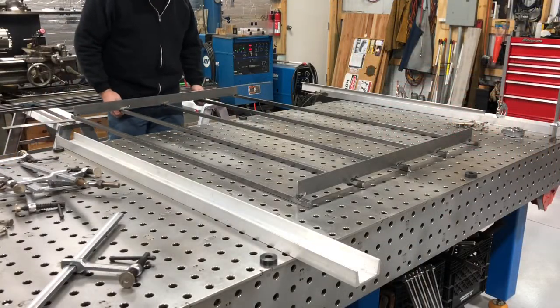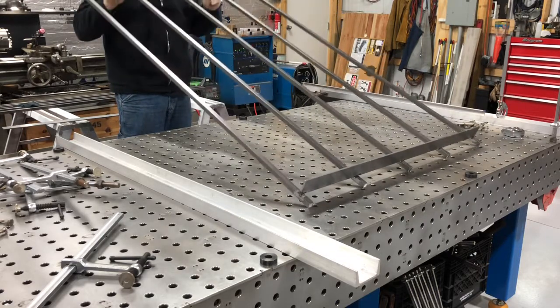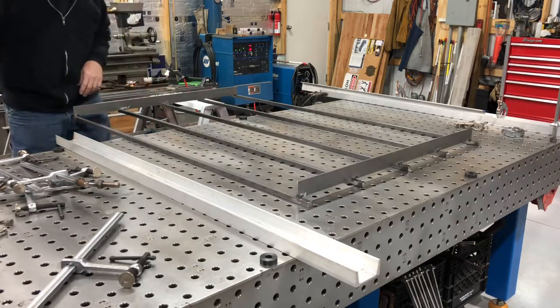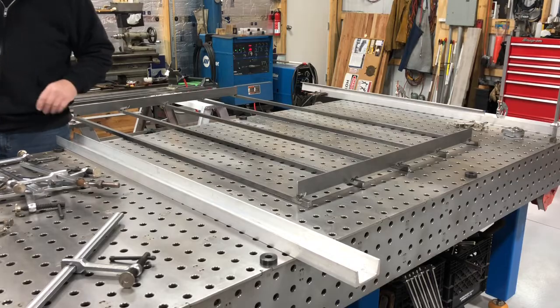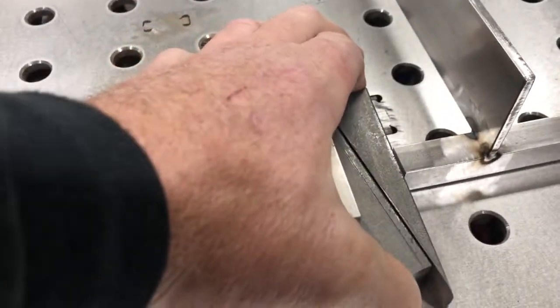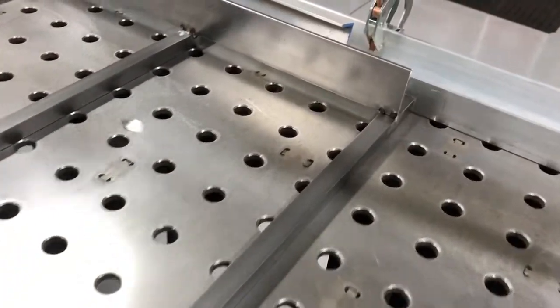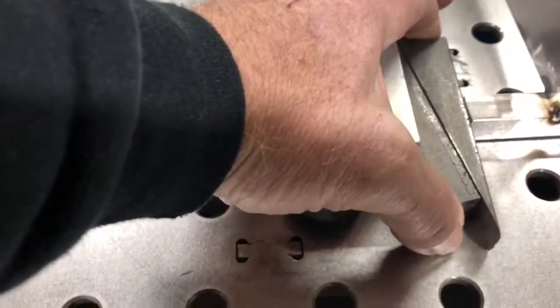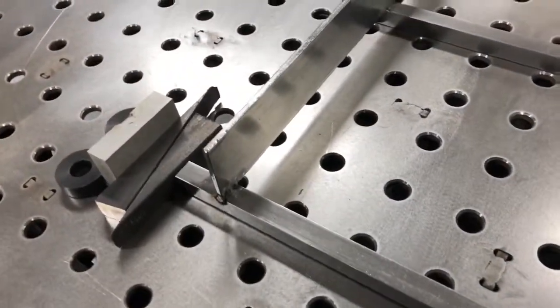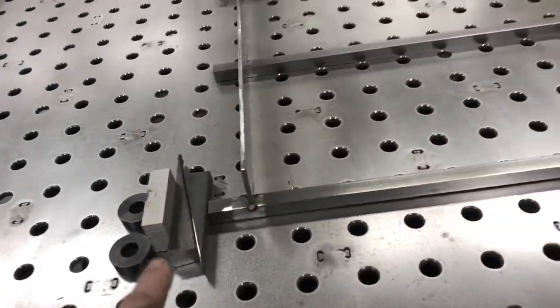All right, so here we have it. I have the jig. I gotta finish welding these — gotta hold square and flat. I need to refigure my situation: a couple plugs, a block, and some wedges. That gets me tight against my bulkhead right there. If it wasn't for that it would be a little racked. That's basically how I'm keeping it square. Naturally it wants to lift a little, especially when I start welding on it, so I'm going to throw some clamps on it. But now it's square because I'm using that edge and the front edge of the table, with these plugs pushing toward the bulkhead I got clamped.